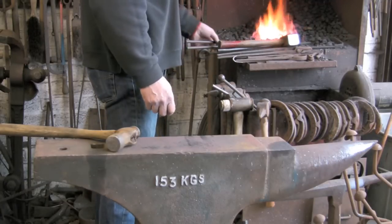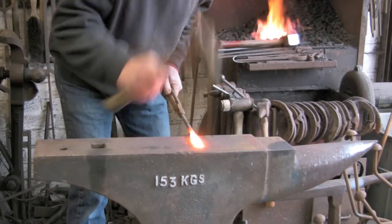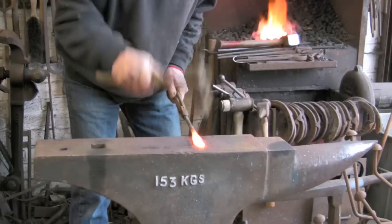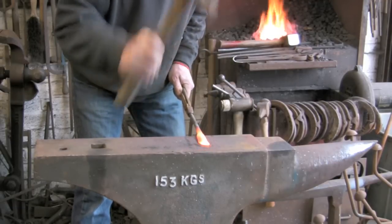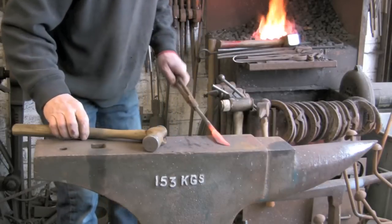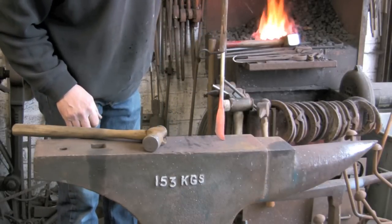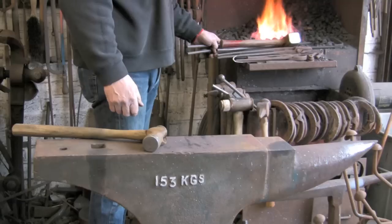I am trying to cut out as much of the heating process as I can. Now thin the blade down one side — the side that is obviously going to be the cutting edge. You can see as it thins out it gets cool very, very quickly. It is looking a bit rough but it does not matter at this stage.